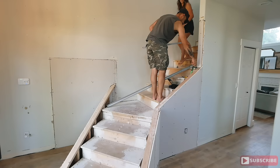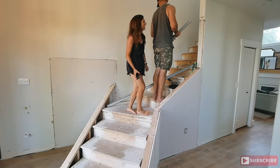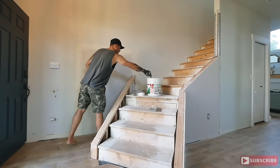All the drywall is hung up using screws, but for the corners I actually recommend using drywall nails, mostly because the head on the nail is flush and flat — makes it a lot easier to apply the joining compound on top and it won't interfere. Now for the actual taping of the joints on the drywall, you're going to need a few tools.